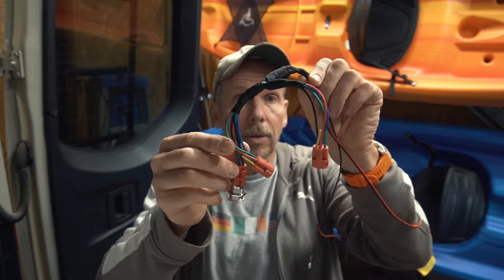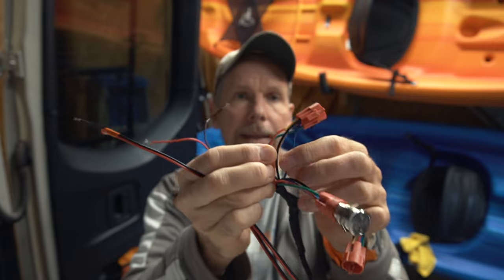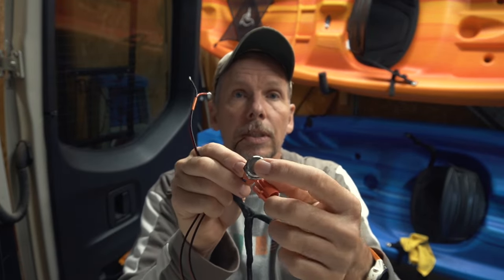The wiring harness might look a bit intimidating — it has more than the three wires needed to operate the bed. It has four wires because these switches have a built-in LED, and the fourth wire (ground) is needed to turn the LED on and off. Otherwise, just three wires would be fine. It started raining, so I'm doing the rest of the installation in the garage.